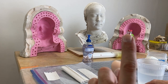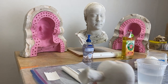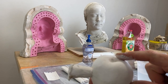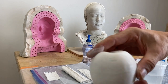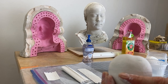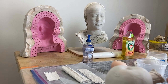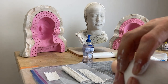In our mold of our finger, we're going to do the same thing — divide the finger up into two halves. This is a plaster casting of an apple. This is called a pour spout. If you look very carefully, you can see a line — that line is the residue of the parting wall, or the parting line. That is the widest point of the object, the point at which you can divide it into two parts.